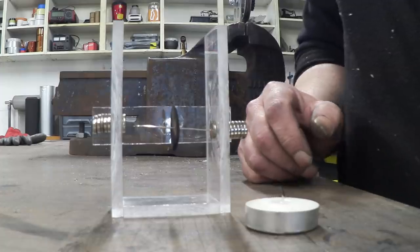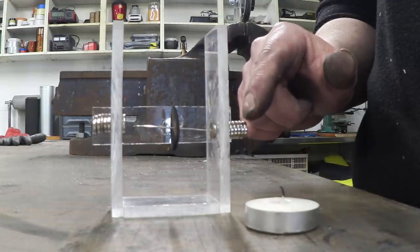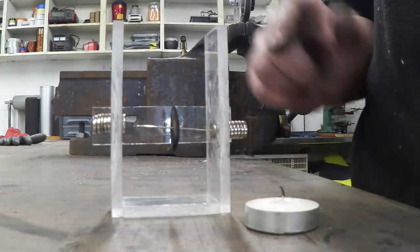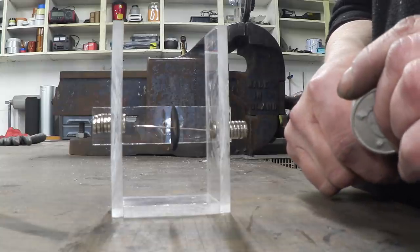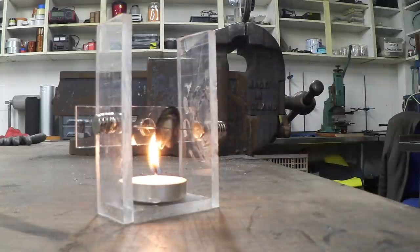It's a rotary version. Actually, one of the things I quite like about this is this bearing. It's a needle stuck through a nickel disc. The needle's in contact with those magnets there, which magnetizes the needle. And these magnets here, actually, are attracting the point of the needle, but not as strongly as this, so it gives a really low friction bearing. At the back there, obviously, what we've got is another magnet. And there we go, we get a rotating disc. Isn't that cool?